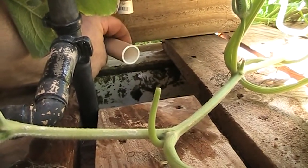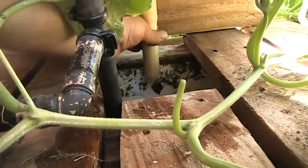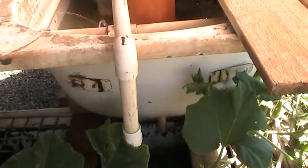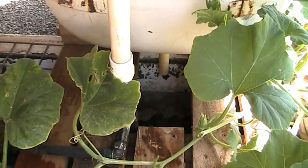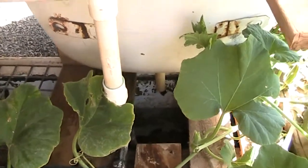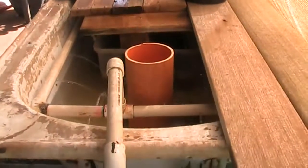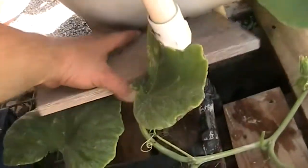Basically the bore size will be the same size as the 20 millimeter conduit I'm using. Aside from that it seems to work fine, but it's very hit and miss — you'll get it working three or four times in a row, and then once it won't start. It means the difference between draining and not draining — it just reaches a point of equilibrium inside the grow bed, filling up at the same speed it's draining, which means it never fully fills up.